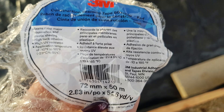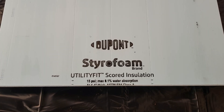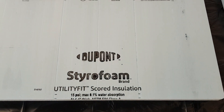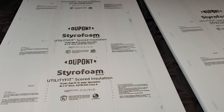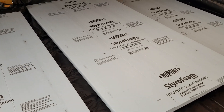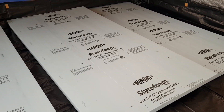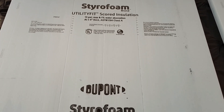This is the 3M seam tape we're going to use to tape the polystyrene together for the flooring. We went with a regular standard big-box DuPont styrofoam board, and this is going to be 4 inches thick — it's a good insulator and gives you an R-rating. So with the weather barrier poly on the bottom, then this polystyrene on top, we'll put the in-floor radiant heat piping on top of the polystyrene.